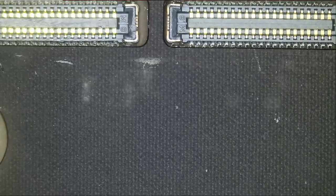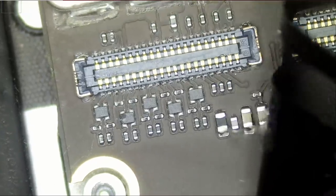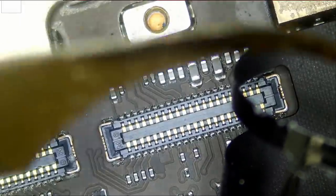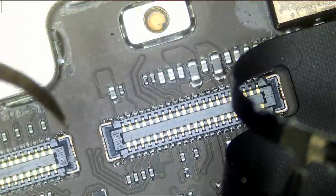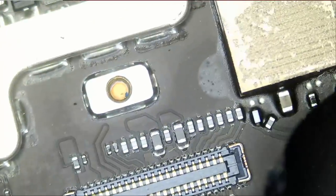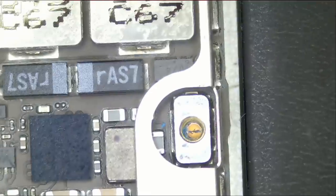I'm not sure if we're going to work on this one first or the one that appears to be more difficult. This one is more difficult because there's no obvious signs of damage on that board. The backlight filters look very good. The touch filter is good on both. We have more filters here that deal with touch — they are also good — and I did a quick visual inspection on the board before I started to record and did not find anything obvious.